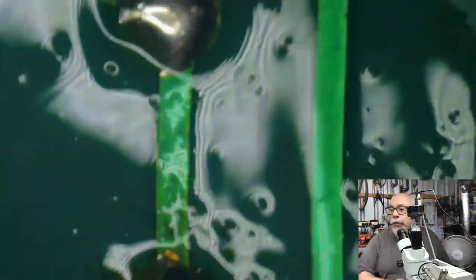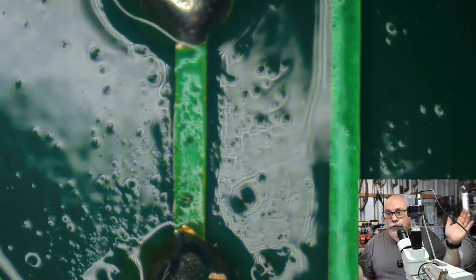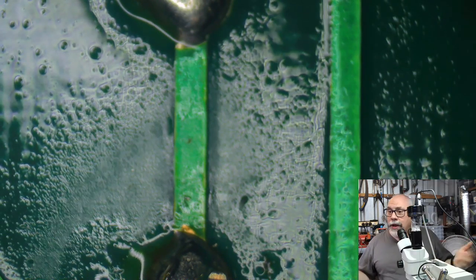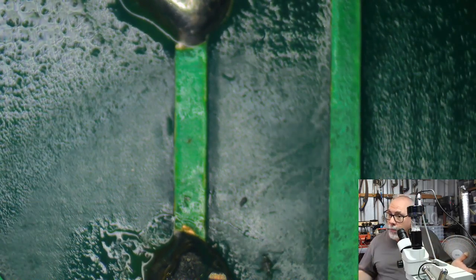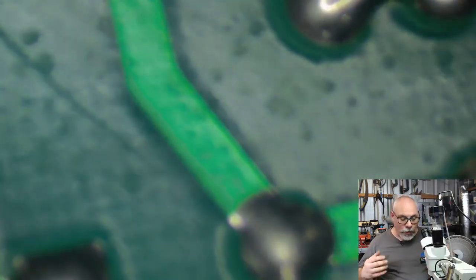It's very common with boards of this age that when you fire it up, you get either no screen and then you whack it on the side and the screen comes on, or you get flickering, or sometimes no picture and then when they warm up, you get a picture. And that is basically to do with cracked solder joints.